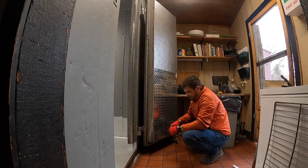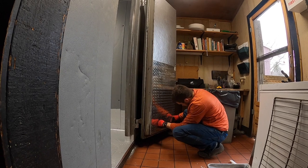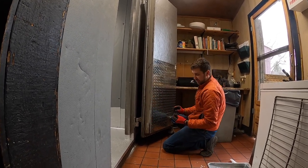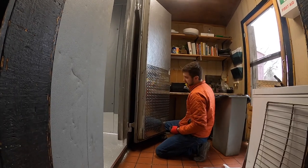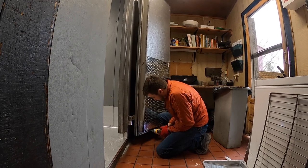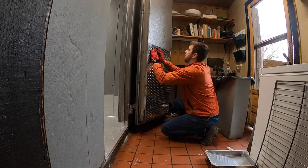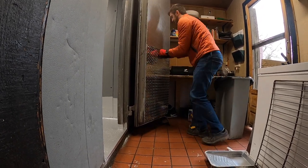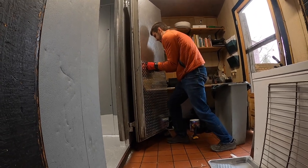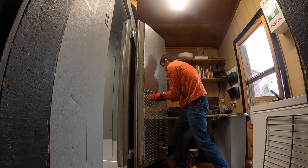Just because it is a cooler, you'll see that there's sealant coming out of my holes. What I want is for when the screw goes through, it catches some of that sealant and goes into the hole — because it's a cooler, I don't want any moisture getting into the screw hole. This is just because when people have stuff in their hands walking out of the cooler, they always tend to give the door a kick, which is why it's in the condition it's in. Just making sure that sealant sticks up out of here so we don't get any moisture down in here.